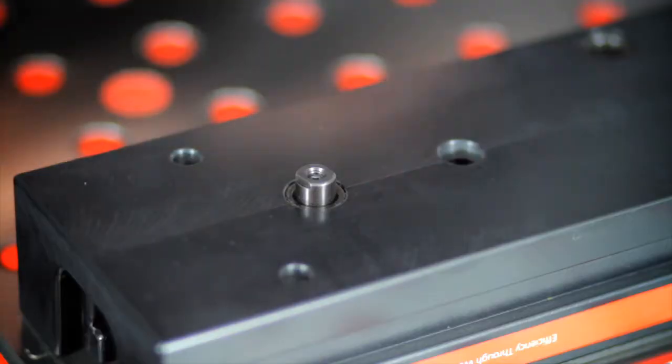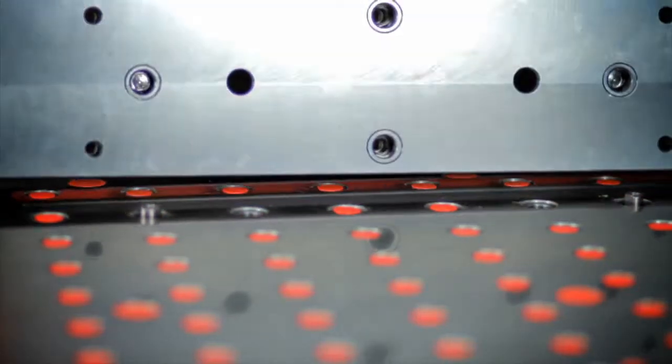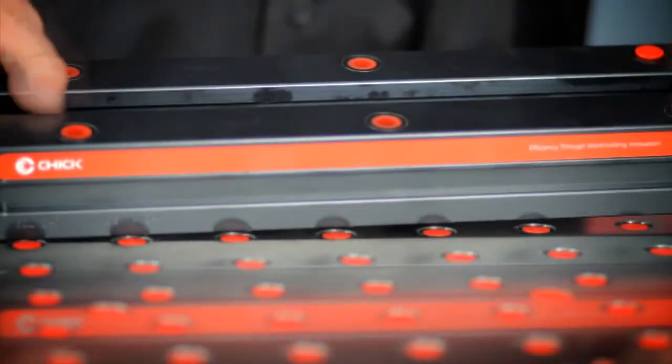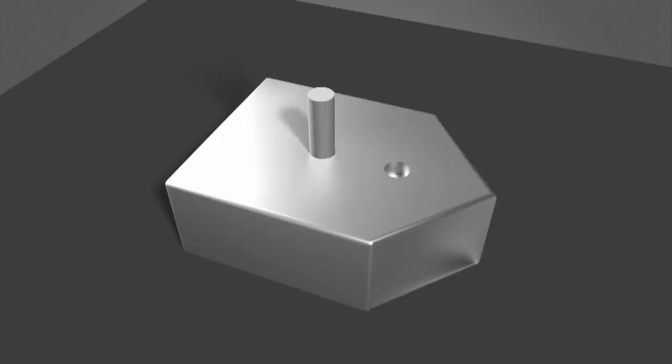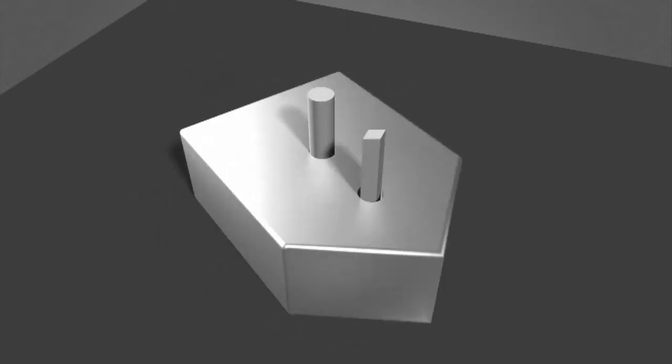The round and diamond pin set can be installed on the bottom of the base or in the foundation. To locate a part accurately using a round and diamond pin set, it would be helpful to understand how this method of location works. A round and diamond pin locates off of existing features, and the location of the features relative to one another is important. It may help to imagine that the points on the diamond pin locate the part as the part rotates about the round pin.